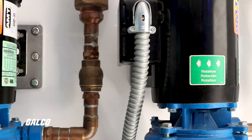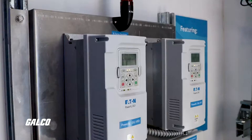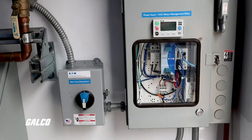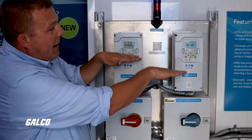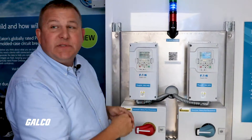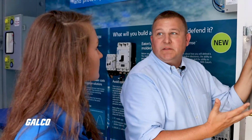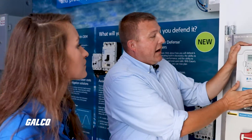They're both running at about 80 to 85 percent of their capacity load. As I increase more, this drive from the sensor is going to say it can't keep up and needs the third motor to turn on as well — you'll hear that one slam on. That third one picks up all the slack, and these two actually drop down, because that's not a variable speed application — it runs at full torque automatically. The drives were able to back themselves down to limit the work based on demand. Really what we're showing here is that VFDs do more than just vary the speed of a motor. They have a lot of smarts and capabilities. There's no PLC in this system at all — it's all run out of a smart drive.